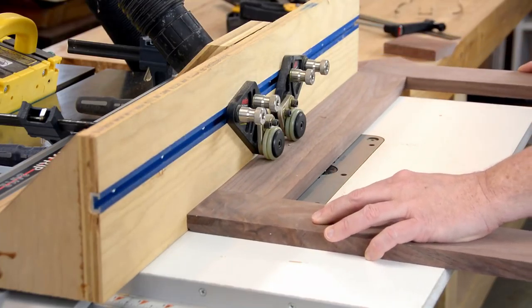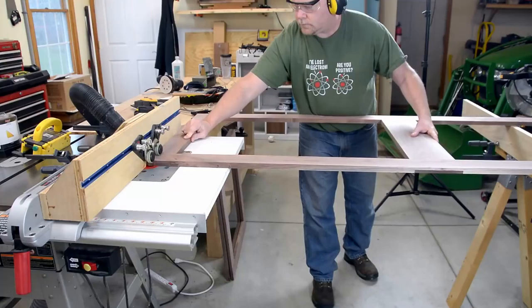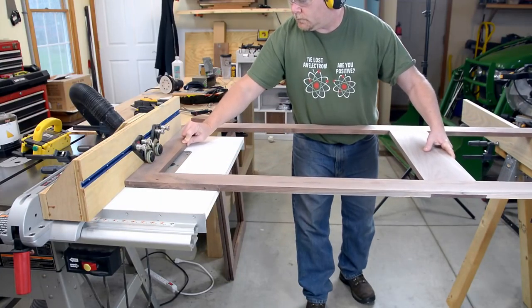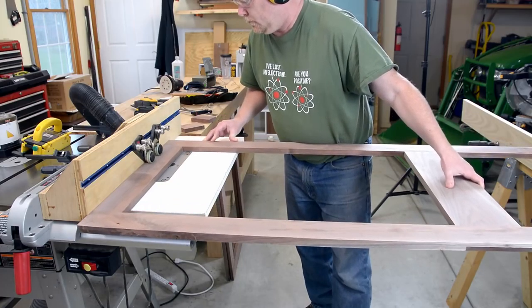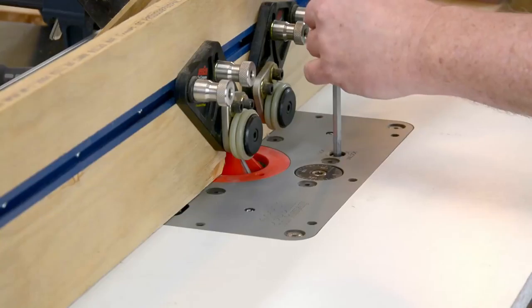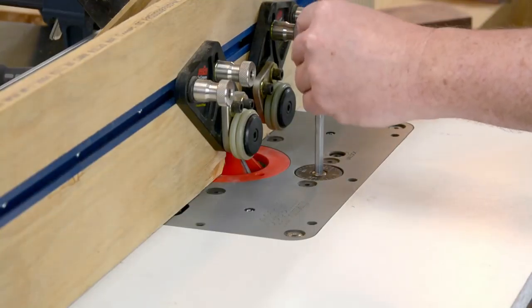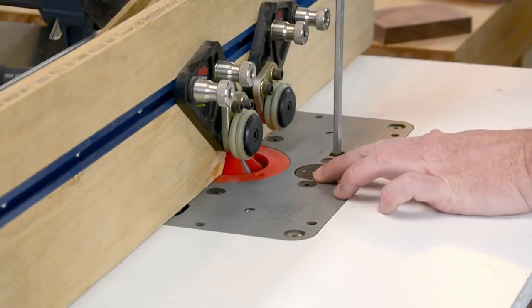Normally I would do this on the table saw, but I just don't have enough room on the table saw to deal with the big pieces, especially the front of the cage. When it's all said and done, the router cuts exactly a 45 degree angle, so it's worth the time and patience to make a couple of passes at it. The very last pass I made was only a 64th of an inch.